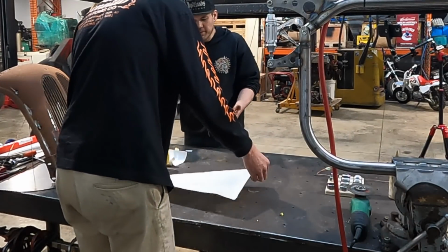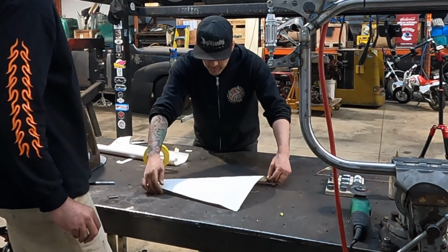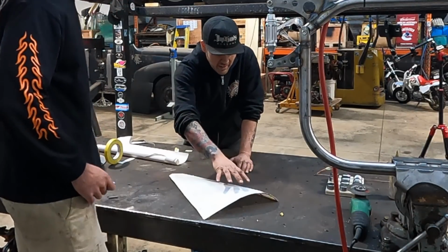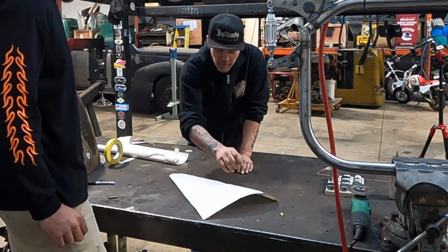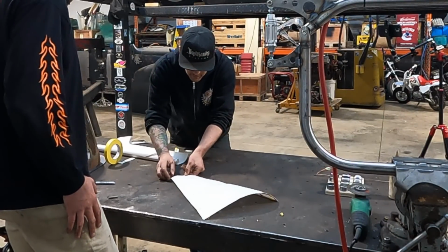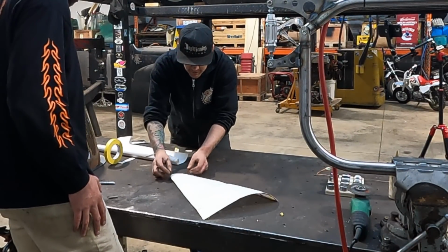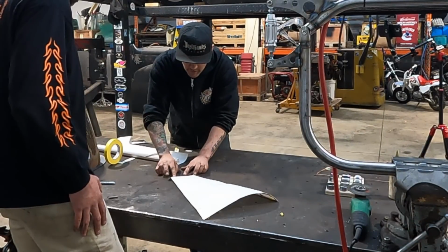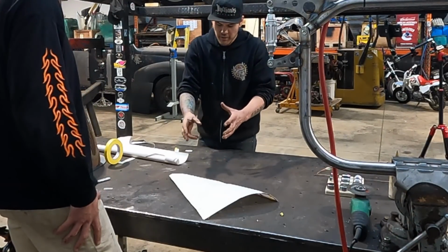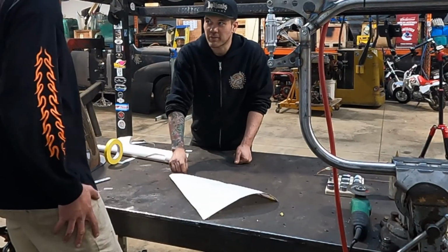There's not a ton of shape in it, so there's not going to be a terrible amount of wrinkles to show us. But basically, this paper template is showing us it's pretty flat. There might be slight variations just because we had a couple that were a little bit high and low. But right where any of these wrinkles are, you're going to pinch a little wrinkle until this edge does touch down. And that's exactly where you're going to shrink. If you were to use a thumbnail shrinker, you would stick it in right until the end of that exact wrinkle, where you've creased it.